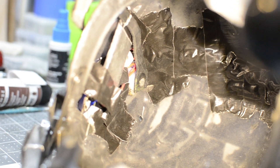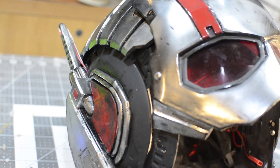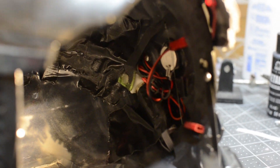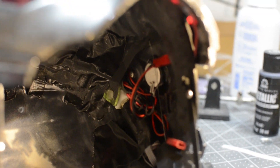They do have motor encoders to run them as a servo, but I don't have that functionality built into this helmet since it just simply needs to go up, hit its torque limit, and then gravity pulls it down. As you can see, there's a 3D printed arm here that allows the connection from the motor to the faceplate, which is just attached via a screw right there. Same thing on the other side — we have the same actuator that completely mirrors the other side. And there you can see the CR2032 battery and the light connectors that connect the lights for the faceplate as well as the lights for the mouth.